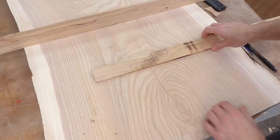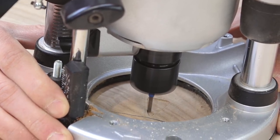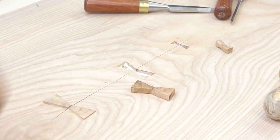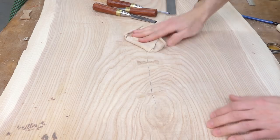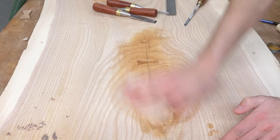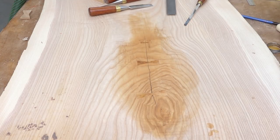Out here in the shop I also made some progress on the waterfall table. Last week I did the butterfly — or bowtie or Dutchman — inlays into that thing. For those I actually used a piece of cherry from the high boy from the gooseneck moldings that had some crotch figure in it, and I used little sections of that crotch figure for the butterflies. I think those look really cool — the crotch figure is kind of subtle but it's a little different looking than your typical straight grain bowties. I did a video on installing those a couple years ago and I'll leave a link in the cards if you want to check that out.